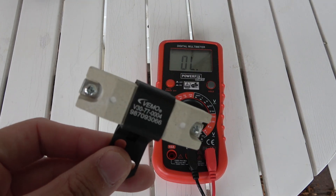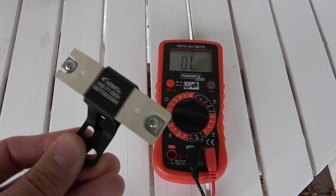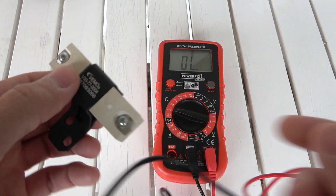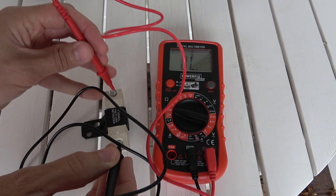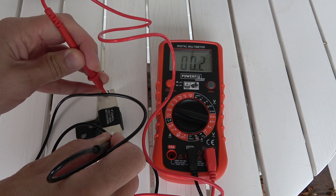What I want to do now is measure this. I have a voltage/resistance measuring device here. We'll check whether the resistance value also corresponds to 0.2 Ohm as stated by WEMO. So this is the resistor from WEMO — you can see the article number on it. It looks like nothing special; it is made from ceramic. When we apply the measuring device, we can confirm a value of 0.2 Ohm.